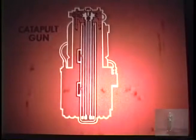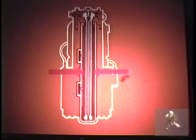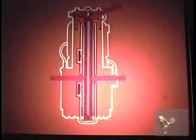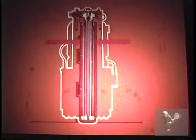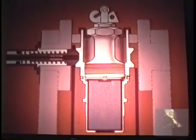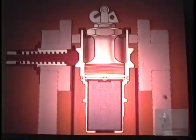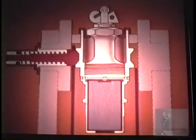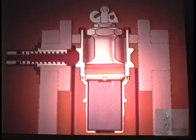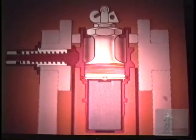It is composed of an outer barrel with two auxiliary cartridges, an intermediate barrel, and an inner barrel with a primary cartridge breech at the top. The outer barrel is attached to the aircraft by mounting lugs, and the seat is locked to the outer barrel by the top latch mechanism on the upper left side of the main beam. The locking action is accomplished by a plunger which extends from the top latch mechanism through the safety latch in the outer barrel and seats in the breech at the top of the inner barrel.